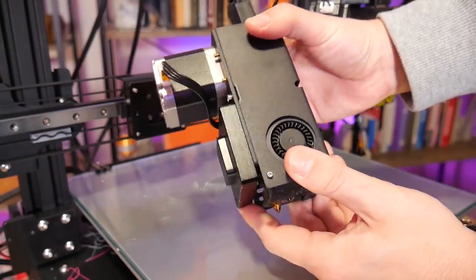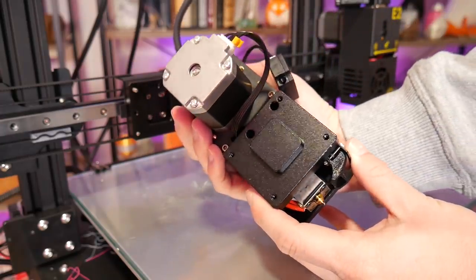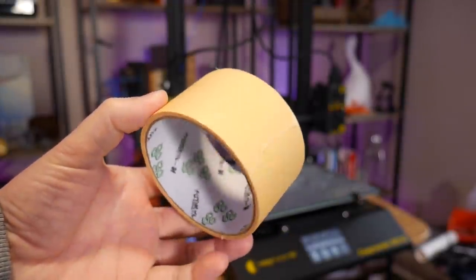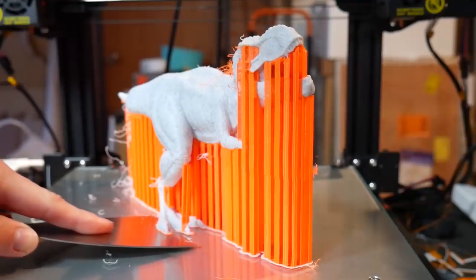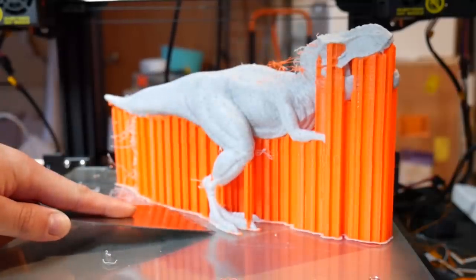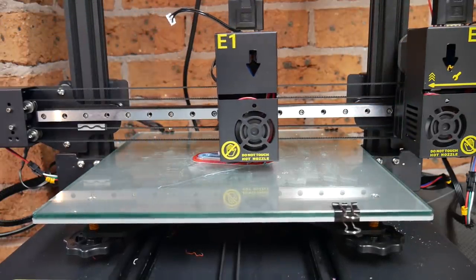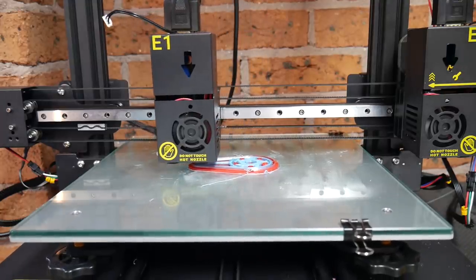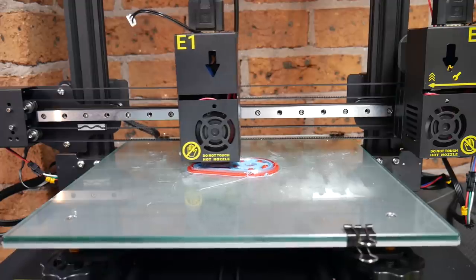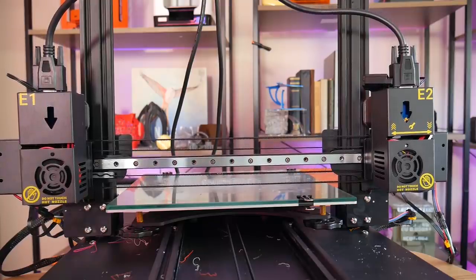I printed a small piece to take up some of the slack, but there's barely room for anything there, and I can't see how the user is even supposed to tension the belt over time because they will get looser. A different approach is much needed urgently. The extruder design itself is pretty nice — they handle semi-flex okay, but I couldn't get really flexible filaments to work, and they never stripped out filament during my tests. The printer comes with painter's tape, but instead I heated the bed to 60°C, used a little glue stick, and all my prints stuck reliably even with thin features. The alignment process is incredibly tedious, especially if you're fresh to 3D printing — aligning both extruders in all three axes using trial and error doesn't feel like an optimum solution. The gantry already has independent Z motors and light gates, so some kind of sensor on each extruder head to figure out where they are could go a long way to make this process more automatic.